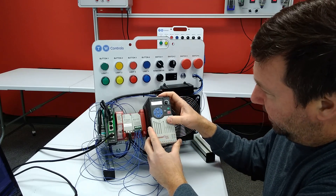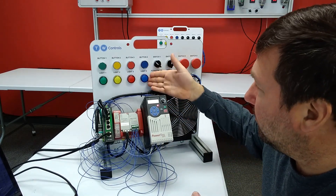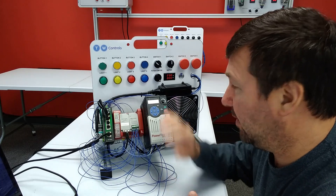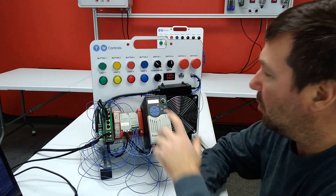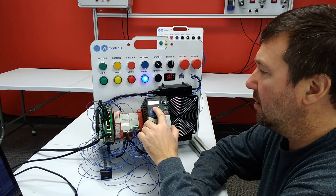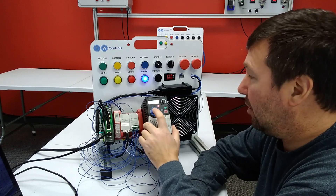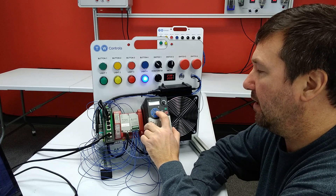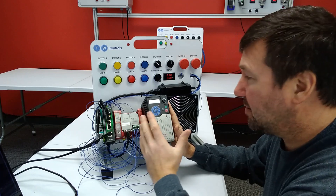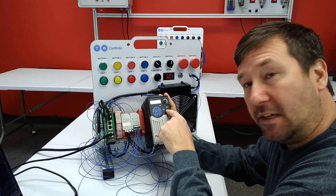Let's go ahead and snap the cover back on the front of our drive and power it up and see what happens. We power up and it's looking promising — we have light number four, which is our blue light, flashing. We need to change one thing in our drive and we're going to talk more about why later. What we need to do is hit the select button — chances are yours is coming up with P and it's flashing. We want to hit up and go to T and then 105. Right now it's set to zero and we want to set that to one. By default this drive faults when those safety inputs are dropped out, but we don't actually want it to fault — we just want it not to run. So change that to one and then hit the stop button to clear that fault out.